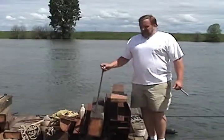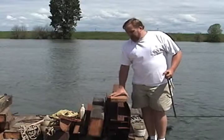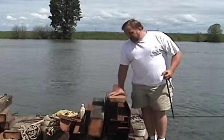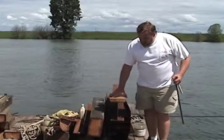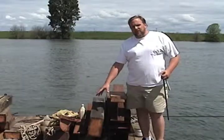Wood is good because it floats and it's a like material in like manner. But the new thing that some people go for is the new steel stringers, because they're forever. The problem with steel is it's really heavy — 22 pounds per foot versus 10 pounds per foot.